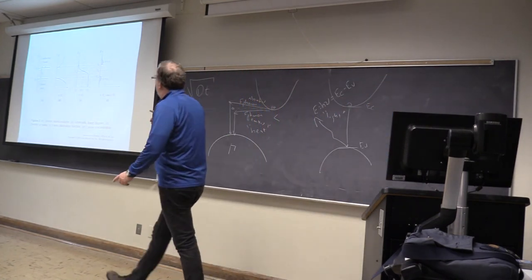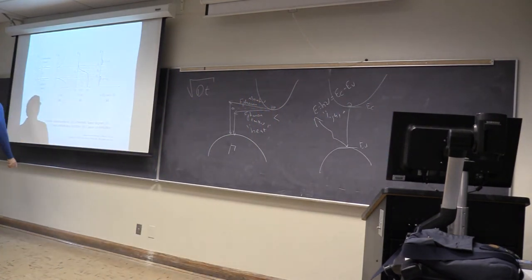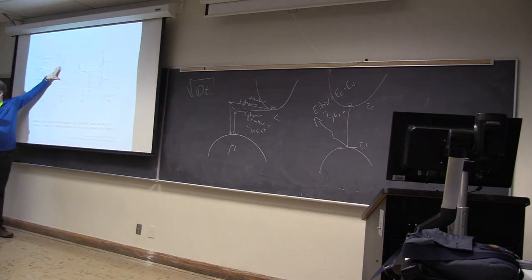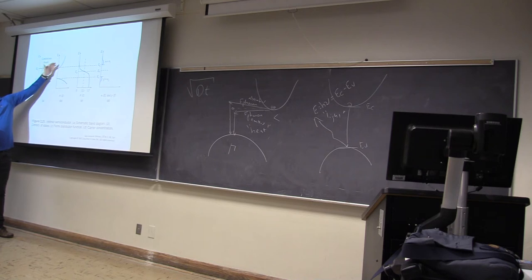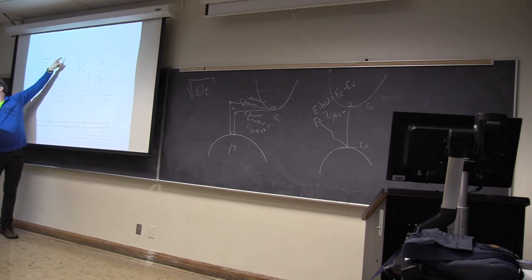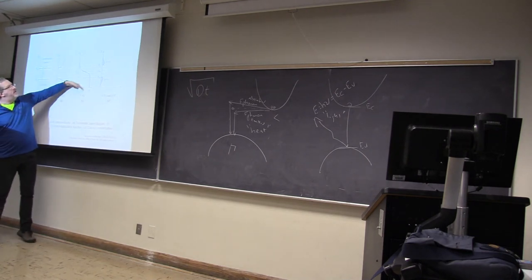So now we're starting to get somewhere real in the devices. We've got our forbidden band gap. We've got the density of states, which you just have to, at this 3030 level, accept that they exist: the number of states at which I can put carriers. This is like our parking garage, right? No parking on the third and fourth floor. Some parking on the second floor, a lot of parking on the first floor. Some parking on the fifth, sixth floor, and then a lot of parking up on the seventh floor, right? So here's our Fermi-Dirac, our coffee cup.